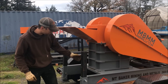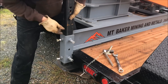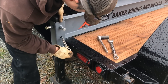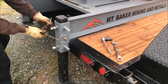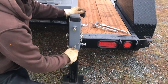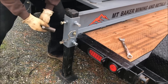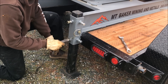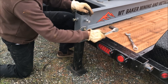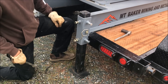This is one of the jack stands in the back and it's held in place by the C-ring. This drops down and you put the ring back in with the pin. It's held in place in the back. Now you can tighten up these four bolts which takes the slop out of the jack stand when you're operating. There's a jam nut on each one that you can tighten up so it doesn't come loose when you're operating.